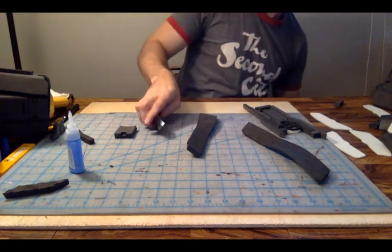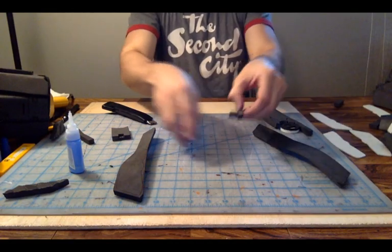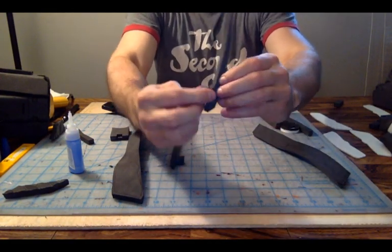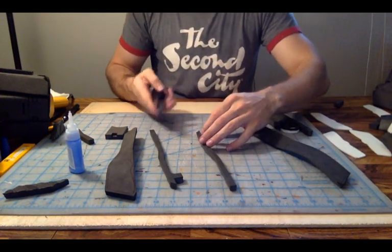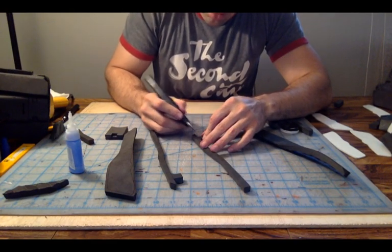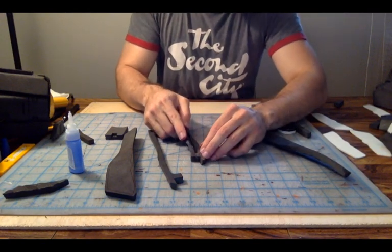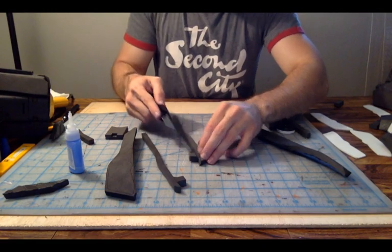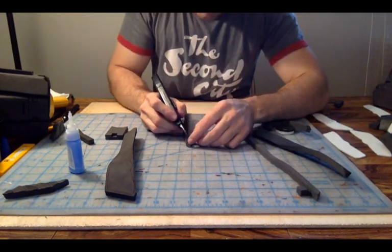Okay. Now with these here, these two little side pieces, we're going to make a tiny grooved cut right there and bend it up on both sides. So cut right on the line. I marked them. Cut right on the line the first time. You're going to go about halfway down on these here. And again, about a quarter of an inch through there. Do both at once here.